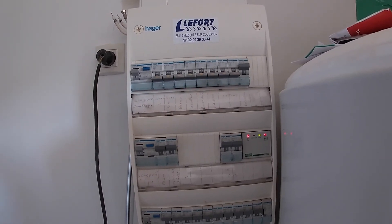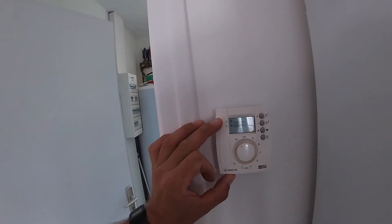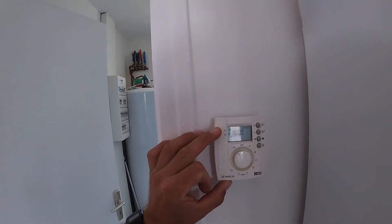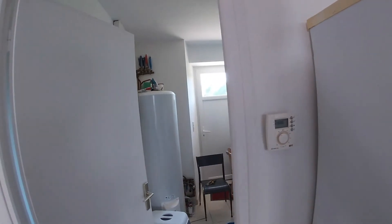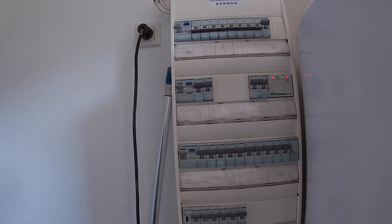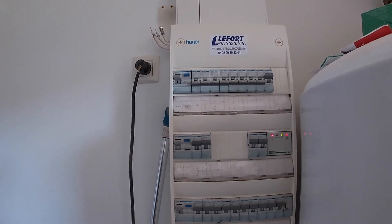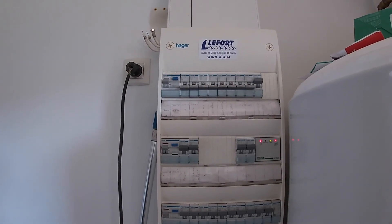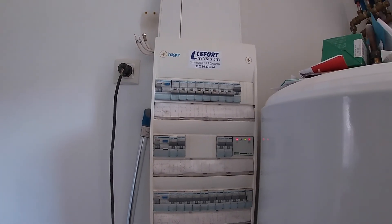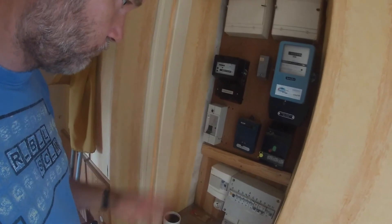It's quite clever. If you see one of those devices it's usually connected to a remote thermostat programmer timer, so have a look for one. This setup is very well labeled and everything works as it's supposed to, which is quite unusual. It means you can have all electric heating and electric water, and if you have them all on at once it's not going to trip the switch. I hope that helps — just a quick overview. Thank you.